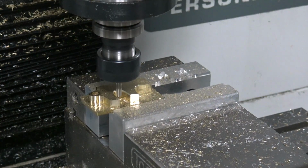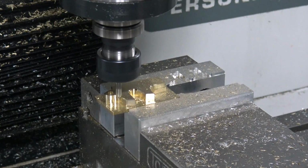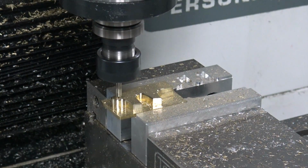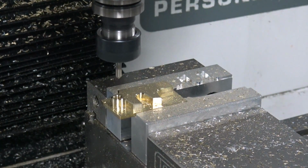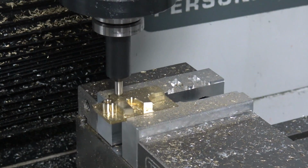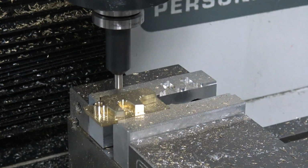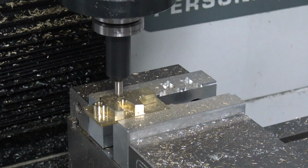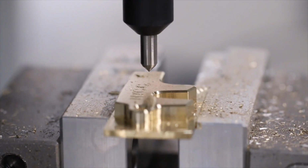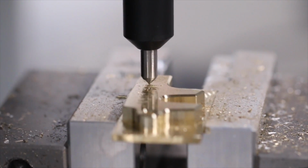Actually, in fairness, that's probably like the first time in 5 years that I've actually chamfered, milled, and drilled with one of those. And engraving our logo on it. I had to stop and change the code real quick because Fusion right now doesn't let you post out with 0 RPMs. Al was saying that they can fix that, because with this tool it works better when you don't rotate the spindle at all.